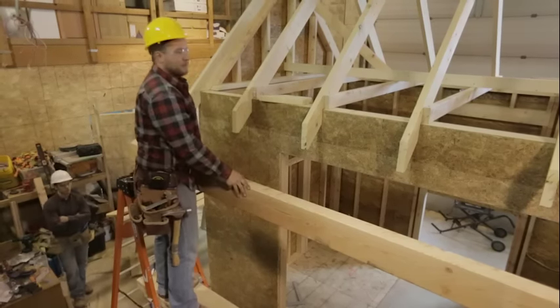These are just our common rafters — we still have to put on our fly rafters and make an overhang for our gable ends. We've run our ridge beam a foot long and we're also going to run our fascia a foot long so we can connect our fly rafters, which are the same as a common rafter but without the bird's mouth. We can connect at the top and bottom and then put some blocking in later. We measured in one foot from the end and made a reference mark — that's our first location for the common rafter, giving us the proper overhang so we can still have support to nail our fly rafter.